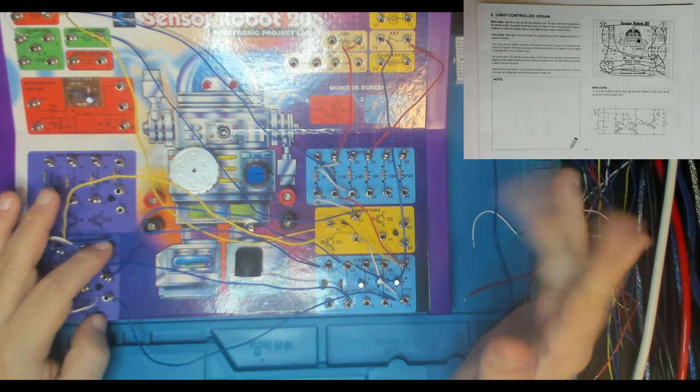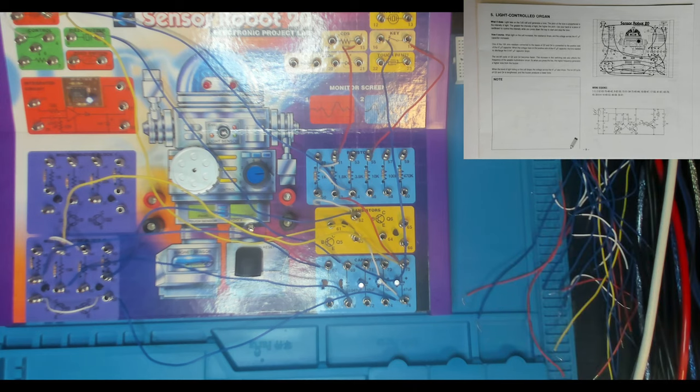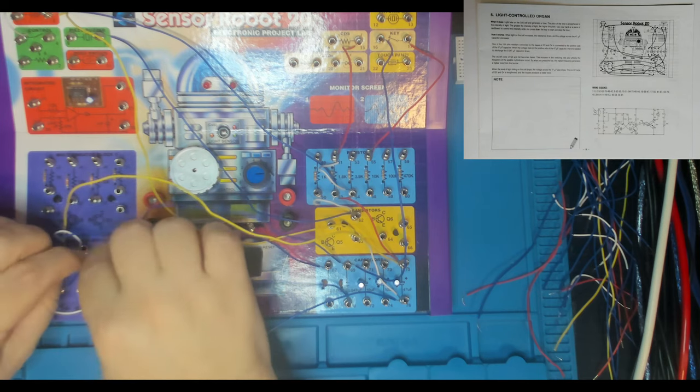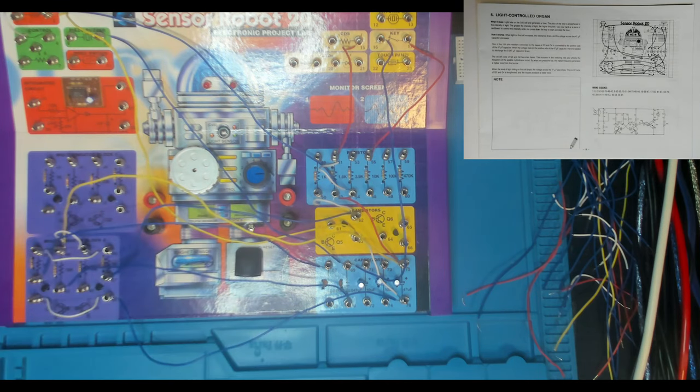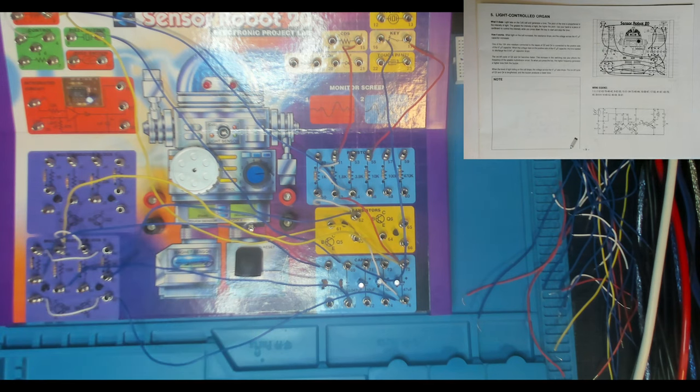45 and 39. Okay, that's just connecting the collectors via their 1K resistors. I'm just going to have a quick look at the schematic here. Yes, okay. So we've just got one multivibrator in this circuit, and it's the multivibrator that creates the tone. And the key introduces, oh, I see, the CDS cell varies the tone because the CDS cell's included in the multivibrator circuit.